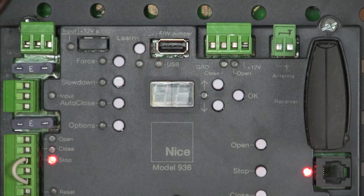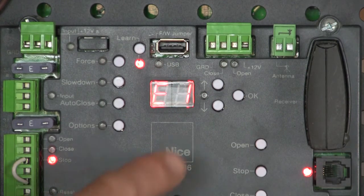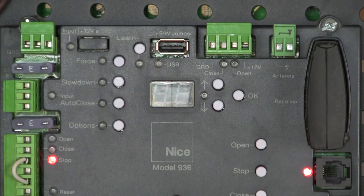It's still going to give me an E1 error message because my BlueBus device has changed since the last time the board was learned. I press and release the learn button — it re-scans the BlueBus input, and two dashed lines appear: I'm ready to operate.